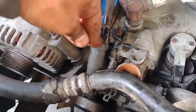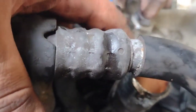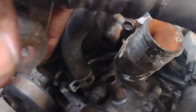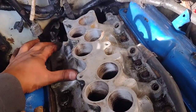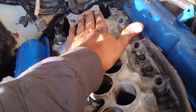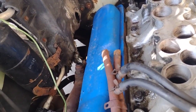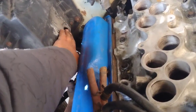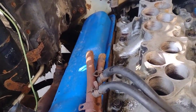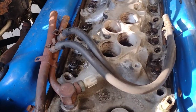So anyways, this one goes here. This hose goes here. I need a new cooling hose. Obviously it goes down here from line to line, a little small one. That goes from the coolant thermostat into the water pump. But pretty much this is done, and then now I gotta put the fuel injectors in. Once you get the fuel injectors in, I can put this top on, and we're done, guys. This job is complete. I gotta do the EGR valve, which I'll probably add right now, the EGR extension, and then go from there. I gotta cover this up before we close everything out. So I got a few things to do before this is a complete job, but we're definitely there. It looks very good. And when I turn it on, I expect it to be roaring.